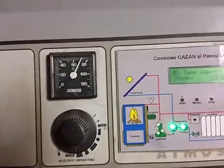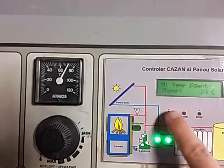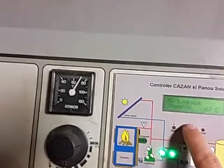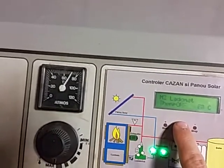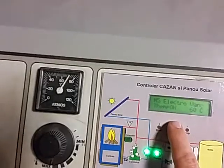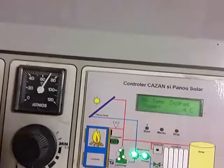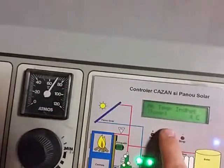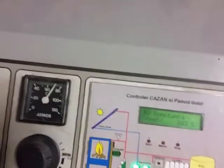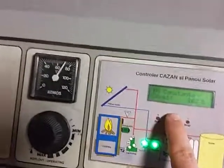The menu allows you to set the system parameters. You can increase or decrease the temperature of the water. You can set the temperature on the accumulator to start and to stop the recirculation pump and electrovane. This is the protection from freezing temperature, which is set to 4 degrees. Also the exhaustor temperature when it stops and when it's on, and a correction constant for the temperature displayed.